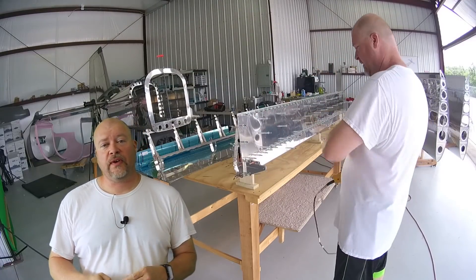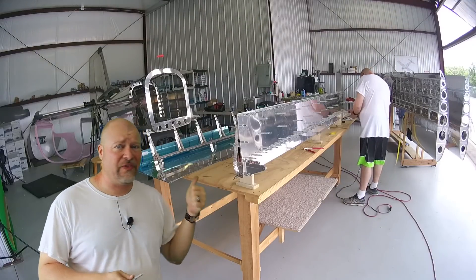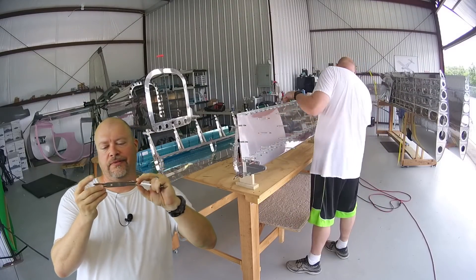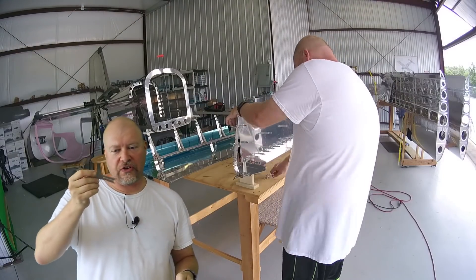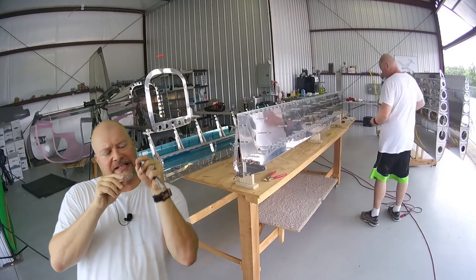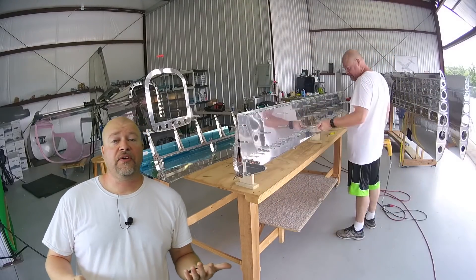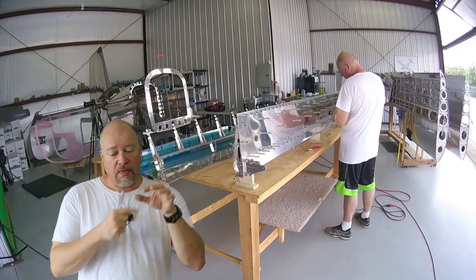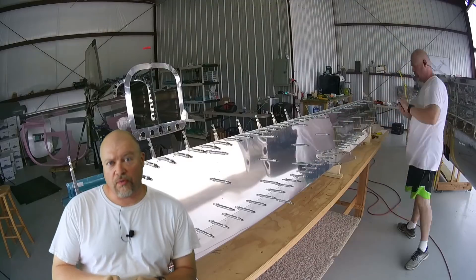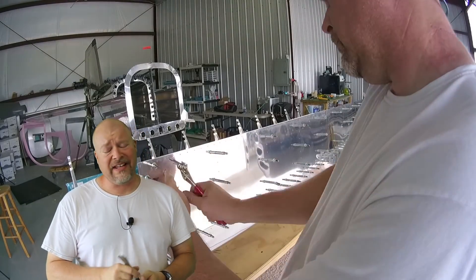Washer wrenches. One of the things that can be really frustrating is when you're trying to insert a washer into a really tight place and you've got big fat fingers, or even normal size fingers, and you just can't get in there. They make a set of super thin, springy — basically pressed aluminum — wrenches designed to hold a washer in a little cut area. There's a bunch of different sizes based on the washer. You can use them to slip down into a difficult-to-reach place to get the washer where it needs to go. Some people use tape on the washer to drop it in, but what if you need to go from the bottom up? Then you're pushing rope — it's very difficult. These washer wrenches are really handy and very inexpensive, and getting a set of them is worth it.